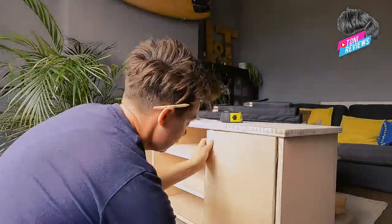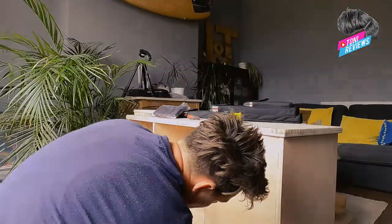Anyway, we're going to get on to the next bit, cutting the backing board, because now I've done all the carcassy bits for the doors and the shelves, and I've fitted all the hardware, all of that sort of stuff. I can now get on to making the backing boards, because what was good about making it was the backing was off and I could work on everything back to front, so I could go through the back of the cupboard and line things up from inside, scribe the doors, because the wood's warped in various little places, or it might not be 100% square.